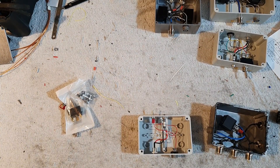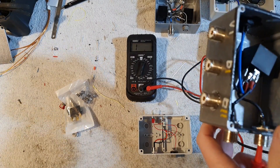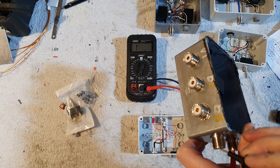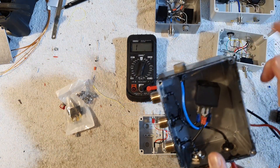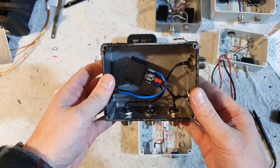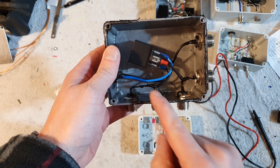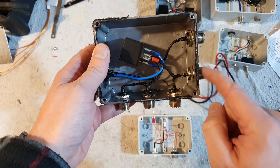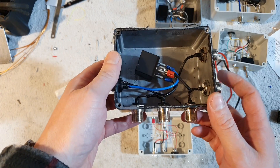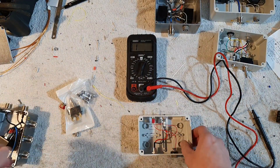You can't test these with coax — you'll just get continuity through the whole thing. So looking here, the receiver is only getting a feed to one side because these are shorted out, and obviously nothing to the other side. If I apply power it would then send the signal to the other side instead. What actually happens is the RF goes here first, then goes through the delay line, and it's delayed to the second vertical. The side that is delayed is the side you'll get most gain from. That's the first box, and it works well. The switch box for that is very very simple — northwest or southeast, whichever directions you want.